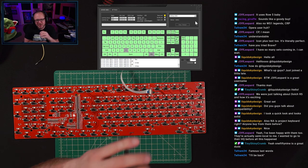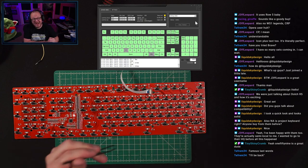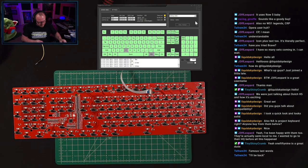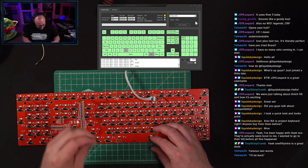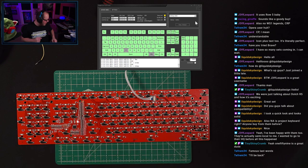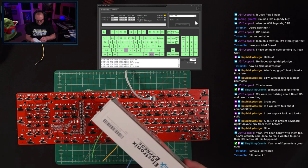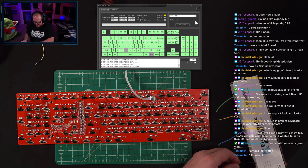So we're gonna add a ton of heat with a soldering iron. What we don't wanna do is put the glue on and then solder. That's important because we're gonna do our trace repair before any of that other stuff. These are not solid core wire. This is solid core wire though. All right, so let's get some stuff to do trace repair.